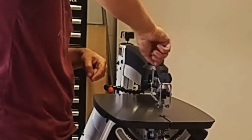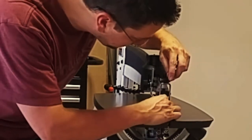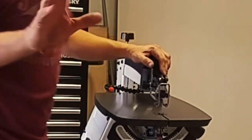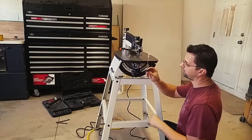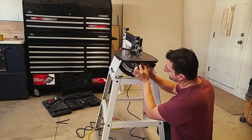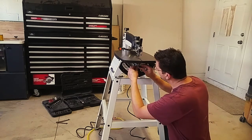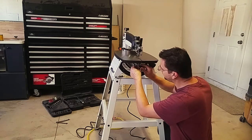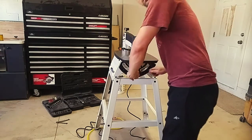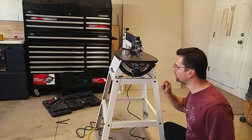The biggest feature Jet touts is the mechanism that holds the blade. On normal scroll saws, you tighten a knob to control the tension — no exception here. The difference is, in one motion, when you put the blade into the center and turn it back, it grips the blade and lifts and tensions it up. That's pretty neat, but here's the bad news. The mechanism at the bottom goes into spacers that you pre-set and keep on the side. When you put it in, there's a little resistance — you have to angle it just right and center the blade in the gap, otherwise you risk twisting or damaging the blade. Guess how I know. It's just awkward enough that you're not going to do it blind — you're going to want to bend down and look at what you're doing. That takes away a little bit of what could have been a really easy blade change.